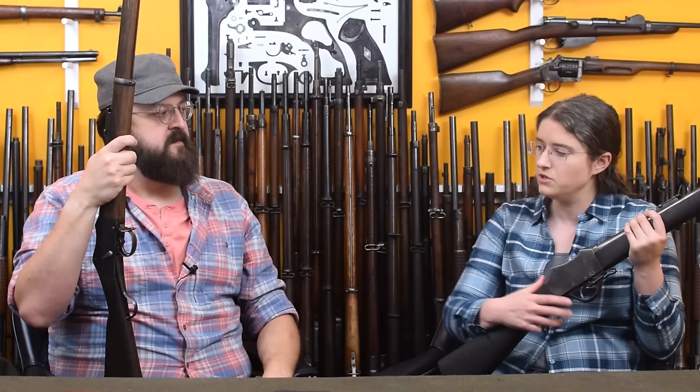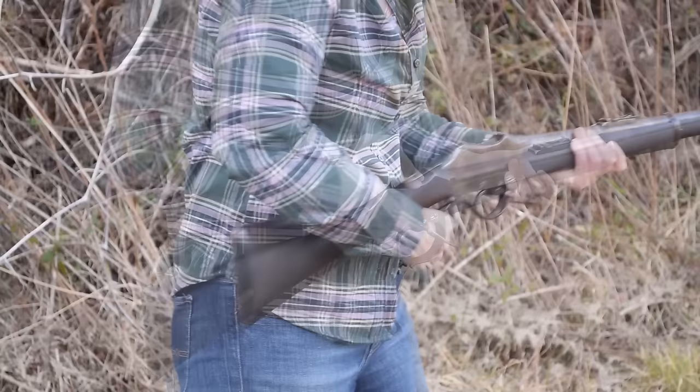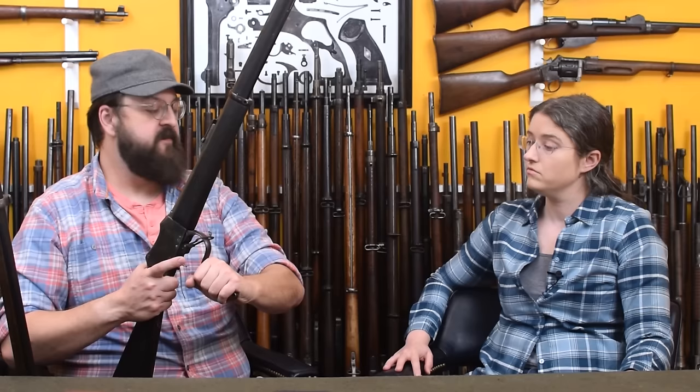Now, I understand that your hammer's back, not down, so maybe that makes a huge difference. You can actually, if you open the action, it is possible to ride the trigger. As a matter of fact, the triggers are so horrendous on this. Let me show you, because it's a little weird. The triggers are so bad on these things in terms of their weight that it can often be easier to relax the system by overextending the arm, which means you're taking the hammer all the way off the sear. Which is the hammer, the trigger rather. The trigger is the sear. The hammer is directly on it. Cool. If I overextend it, I can pull the trigger without any pressure whatsoever. Oh, yeah, I see. And let it ease down.